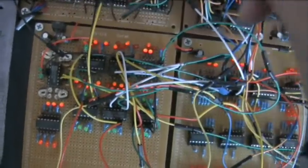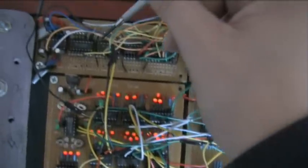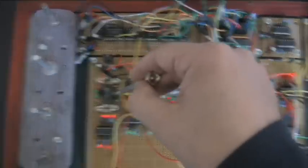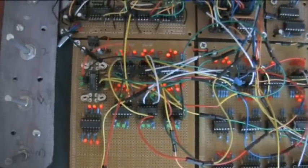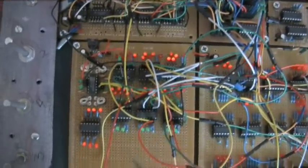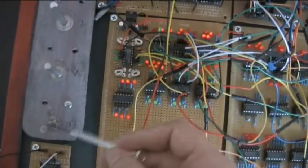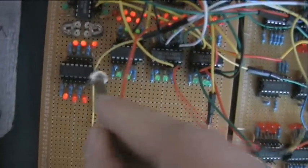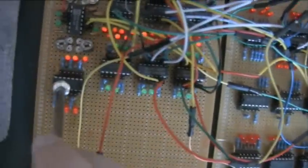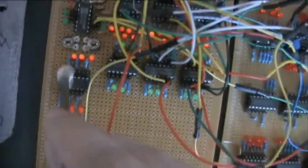So then there's the 4093 chip and three 4040 chips here. These are the controls and pots for this oscillator. I got into this idea of using trim pots for the mixer and basically everything that needs potentiometers, just because the full-size pots are expensive as hell, and these trim pots are only like 30 cents. Also, I wanted everything to fit on one cork board.